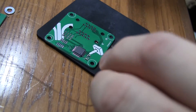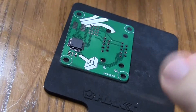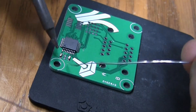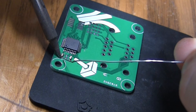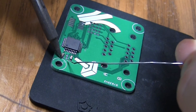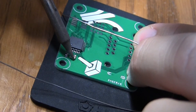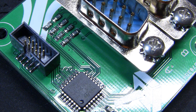Now I need to go around to the other side and solder it. One of the other tricks to this is using as fine a wire solder as you can. If you use big globby Radio Shack solder you're gonna use too much. Here it can be hard to get that minimal amount on — that's too big a ball but it'll work. Try and get a fillet there — or fillet as some people say. It's hard to see on video but there's good coverage on each end of the component, and the end of the capacitor is fully covered.